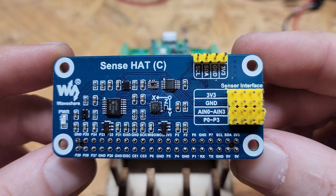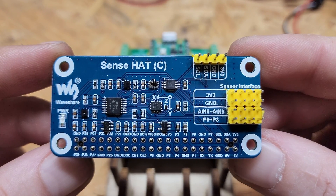I'm interrupting myself to make a correction. I will not be adding the accelerometer. I shot a sequence involving this board, which I bought because of an issue involving an INA3221 chip I'll talk about later in the video. That bit would have been in here, but it went a little wrong. I thought I would be able to access the sensors on this board with the Pico because it's I2C communication. However, this board does a few special things with other pins and I just don't have time to reverse engineer each of those things. Also, the MicroPython library for some of these sensors would need to be written from scratch, and again, I just don't have time. I will be using this board at some point because I think it's really neat, but it will be in a different build and I'll be mounting it to a Raspberry Pi Zero W. Anyway, back to the build.